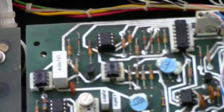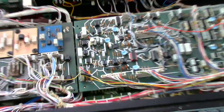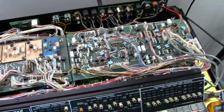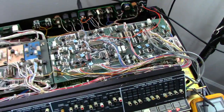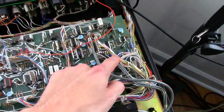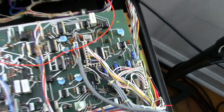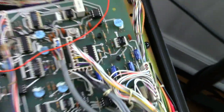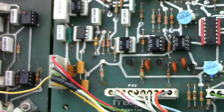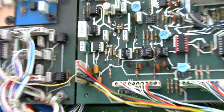As you can see, I put high-grade sockets in there for you for the LM358Ns. So you're going to be in business once I get it all fixed up. I went on and re-capped all the electrolytic capacitors as well as the tantalum caps I always talk about. I put in these nice new parts — still using tantalums.